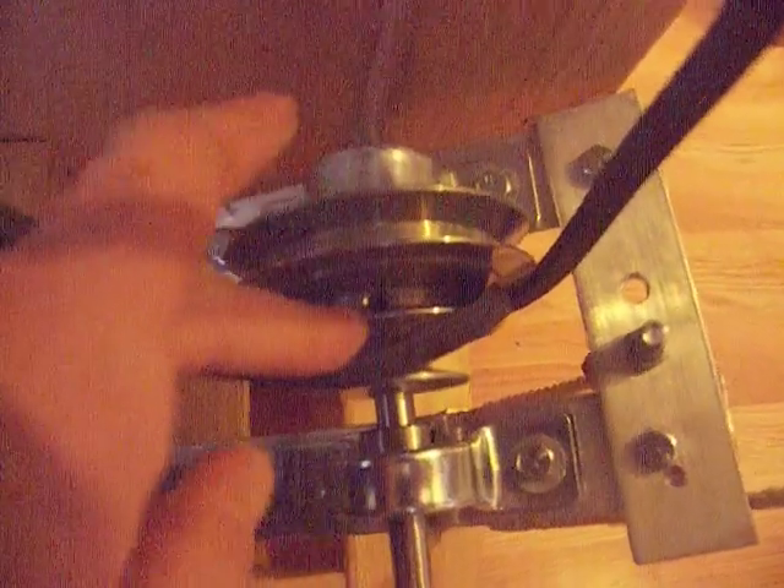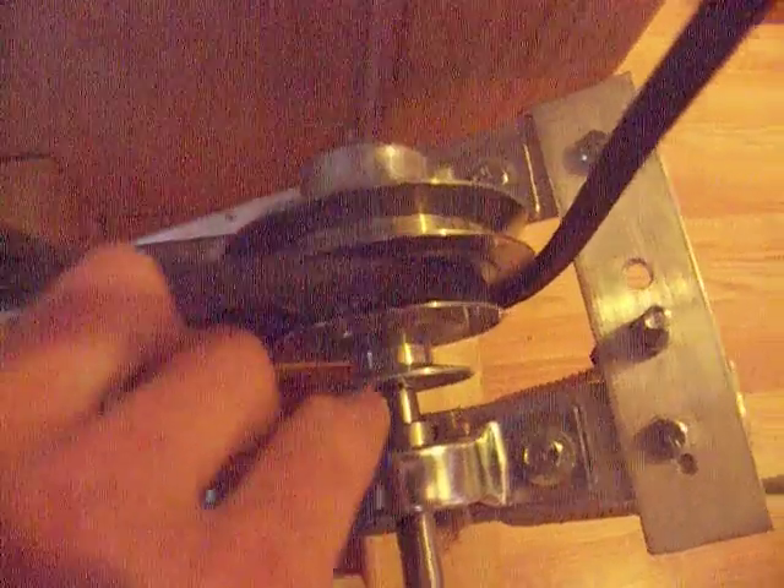That gives us a framing for the pulley system. This pulley system consists of two different ball bearings — here's one and here's another. These are pillow bearings, meant to hold a shaft. This shaft is six inches and measures one-quarter inch bore. This is a three-pulley system: the top one is four inches, the bottom one is three inches, and the very lowest one is two and a half inches — that lowest one we will not be using. Everything here is bolted onto the aluminum bars, which are then bolted onto some hinges, allowing the pulley system to loosen and tighten.